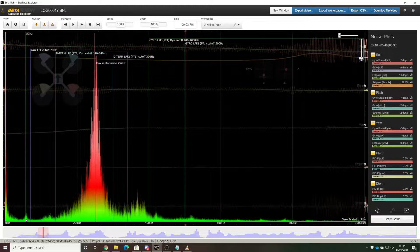There's a spike here that could be prop wash — that's in the prop wash frequency range. I'm not sure what these other ones are; they're pretty small. So really on roll, it's this main huge resonance peak at 250 hertz that we need to be paying special attention to.